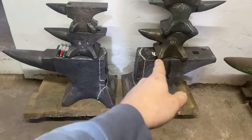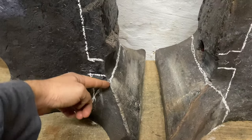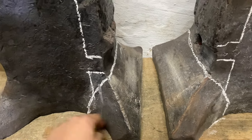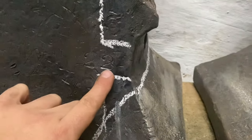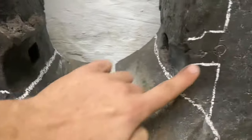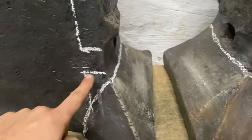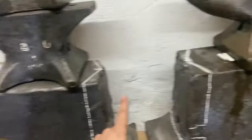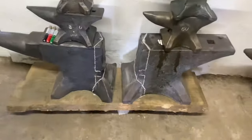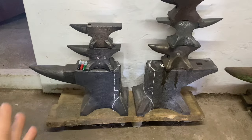As you can see on the big anvils, I've started marking off bevels. I need to remove the feet. I've borrowed a cutting torch from my friend, so I have the equipment now to remove all these chunks of steel — we're going to be removing the feet completely, both of them, then bevel this down. I have to come in carefully because that's too close to the weight stamp and I really don't want to damage that. For those of you who are new here, I'm going to be marrying these two anvils together to make one massive, plus or minus thousand pound anvil.